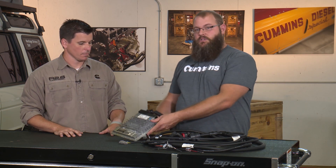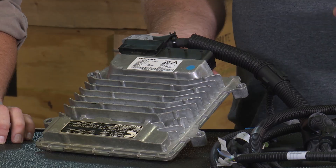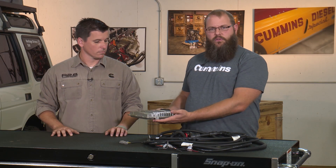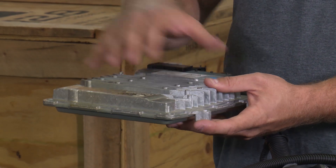One main thing to consider: if you look at your ECM on the top it has cooling fins — you need to make sure you have adequate airflow around the ECM so it doesn't overheat. Number two is vibration; the installation manual talks about dampening, so using rubber dampening on the mounting bolts will prevent excessive vibration from damaging the sensitive electronic components inside the ECM.